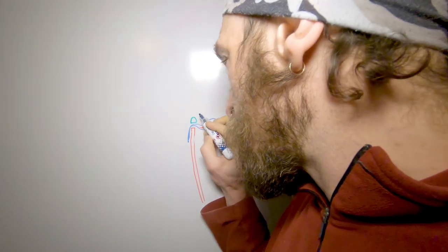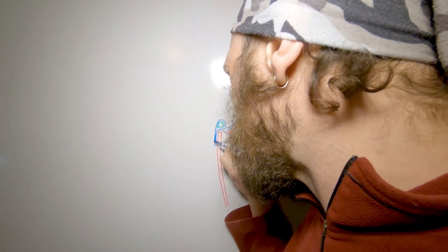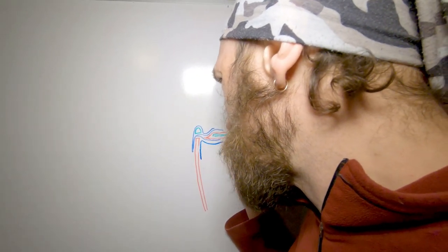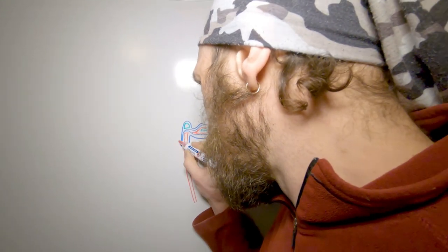to re-establish the line of the deck rail, blue, and then a final piece of glass over the top, making the deck hull joint back to where it was, and then finish it inside by replacing the tape around, and then we'll be done. And then replace the fixing through, and that's a proper repair. That's not just patching it up, that's making it back to being strong again.